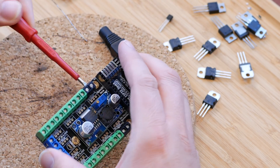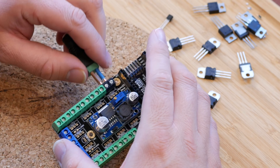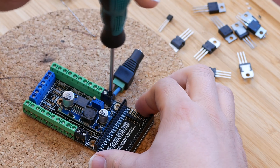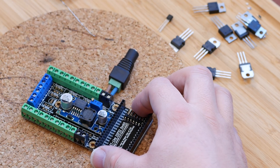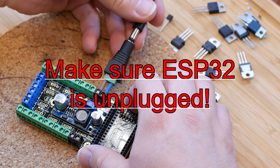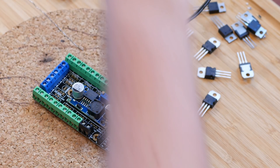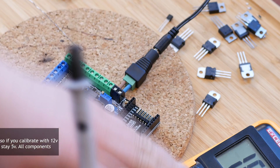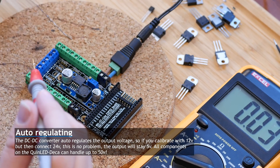Okay, let's connect the board to power to set the voltage converter. If you haven't soldered it on yet, you can also choose to solder on the Dallas temperature sensor first. In earlier revisions this was a problem and should be done after setting the voltage converter, but this has been fixed in revision 5. Let's set the voltage output to 5 volts.